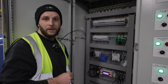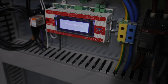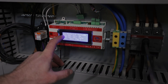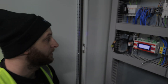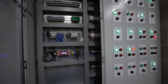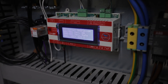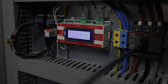Downstairs we have a little shut-off button as well, located beneath the fire panel — if they want to shut the system off in an emergency without the fire alarm going off, they've got a button to do so. On here you can see normal operation: DC is about 750 volts. We trick the system into thinking the button's been pressed — almost immediately we get PV voltage reducing. Within a few minutes this will just decrease down to a safe touch voltage. It's decreasing quite quickly now — 600 volts. Really good bit of kit, especially commercial. Extra safety, peace of mind. Once the system's deemed safe, we can turn it back on. Immediately it goes back to PV normal operation and the voltage will start to increase and ramp back up to our operating voltage.